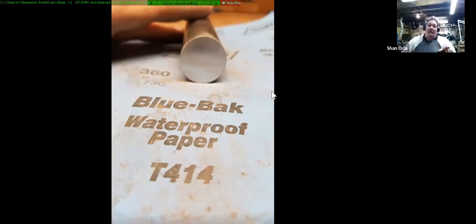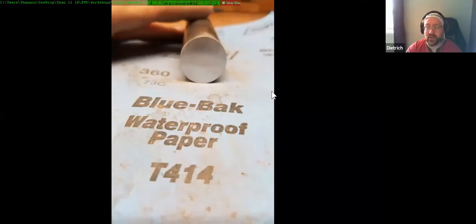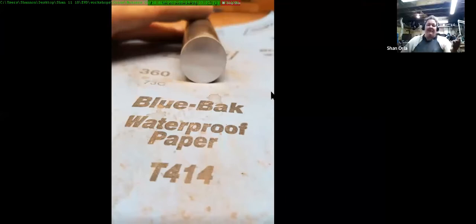It took me about a half hour to do the face by hand from cut rod — I clocked it. When I did it as a complete newbie it was about an hour or so. It's not an offensive amount of time, but it is the grind. You can use other tools; you want them to be flat. By the time I get to 1000 grit, I'm doing it by hand because I am steadier working slower, and when you make a mistake at speed it's a bigger mistake to fix.